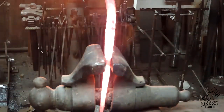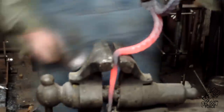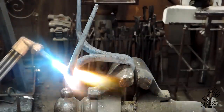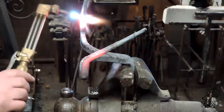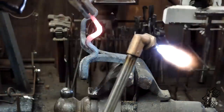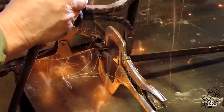This other leg — I'll get it into the vise, feels a little bit quicker, 90 degrees. I'll take that over to the anvil and straighten it out. This thing is such a weird shape it won't fit into the forge anymore, so we're just going to take a torch to it, do our final straightening and shaping. There we go — and we'll get this thing welded on. Like I said, it was nothing more than just some fun — it needed a leg and I didn't want to just weld a peg on the front of it.